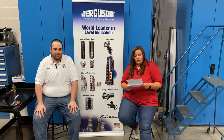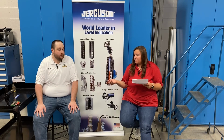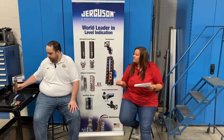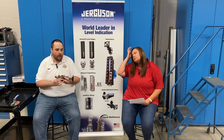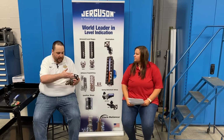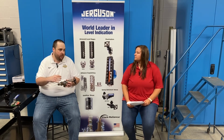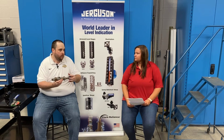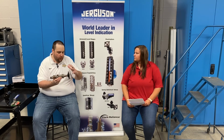All right. Well, hey, jumping off that, we had a couple of our customers ask, you mentioned the old 60 series valve. If someone has an old 60 or 70 series valve, are the dimensions the same as their low emission counterparts? On the 60 LE series, of course replacing the old 60 series, what we call the critical dimensions from the process connection to the gauge connection where the customer would mount, those are identical dimensions. So they could swap out, they could put a 60 LE series where an existing 60 series valve exists. The LE series valve is longer on the back end towards the handle, but typically that's not an issue because the operator has to get their handle in there to manipulate the valve anyway, so there's usually open space where the handle is.